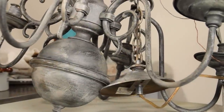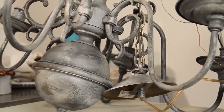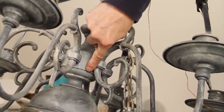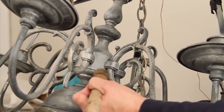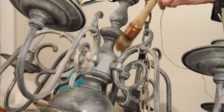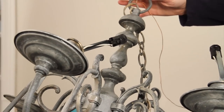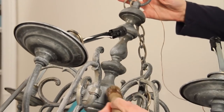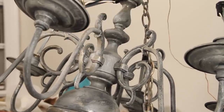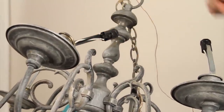When applying the wax to your chandelier, you want to apply it where there are ridges or carvings — in the areas that are recessed. You don't want to completely cover the surface with the dark wax. It's just a small accent. Let your high areas be exposed and this will help the more narrow areas recede.